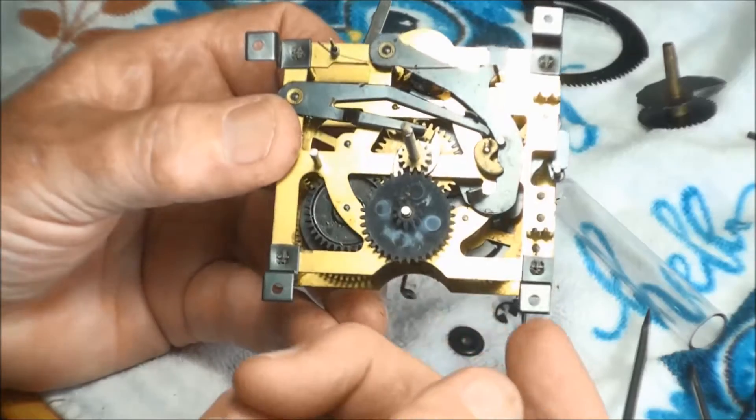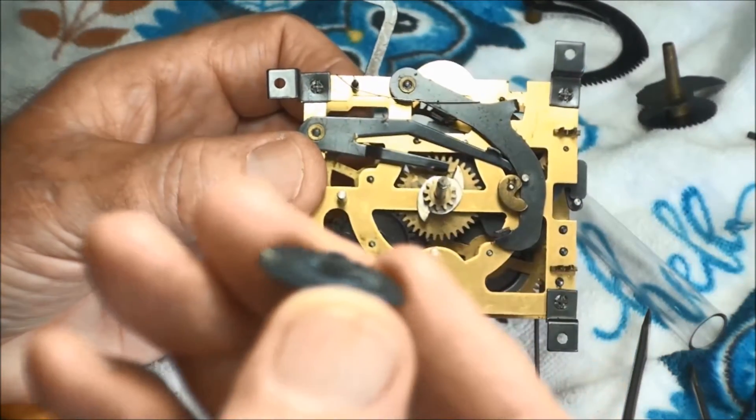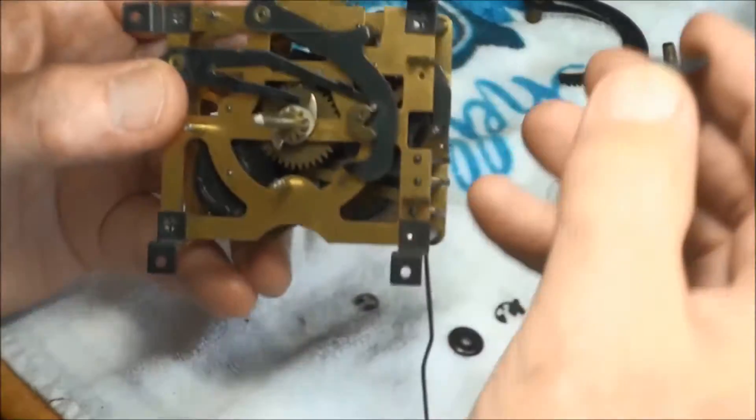It can only do so many times, and eventually you might bend this gear or lever. It can also get stuck in there. On this clock there's a spring wire that goes over and helps push this down so it counts right. We got the E-clip off of those two. There's an important washer here meant to hold this gear down and also hold the snail down so it doesn't travel out too far. Now this plastic gear comes off — it's already got its riser on there.